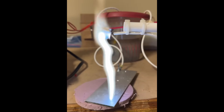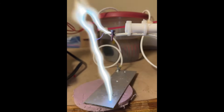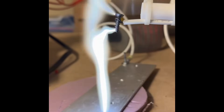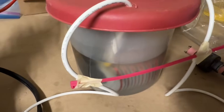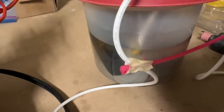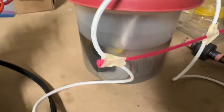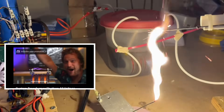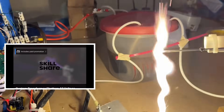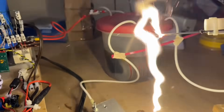That's some serious output and I'm only running at 35 volts AC — I'm a little scared to go higher. The wire is rated for 30,000 volts DC but I don't think it's rated for the same voltage AC. Look what happens when I bring the leads near to each other — there's a lot of corona discharge and risk of breakdown if the wires touch. The sound of the flyback becomes audible when you slow the video down, and at 16.8 kilohertz it could bother your pets, especially dogs. This device beats the output from Jay from the Plasma Channel's flyback transformer, though his was portable and this is not — so this is cheating just a little bit. Thanks for watching, and please check back for more high voltage experiments on this channel.